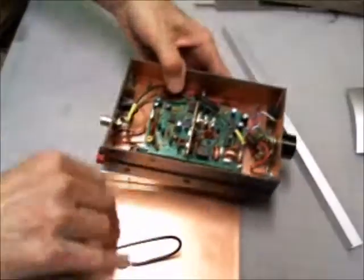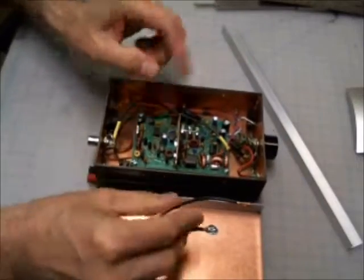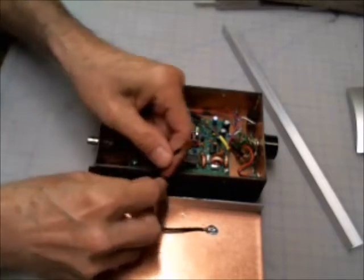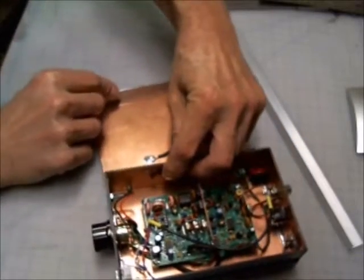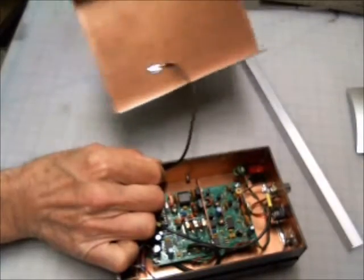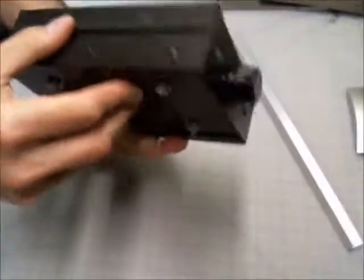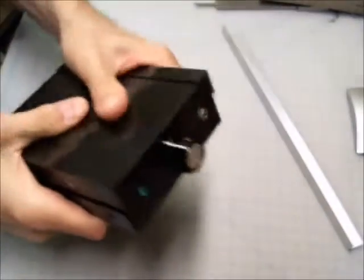In order to maintain ground contact, I've got this heavy 12-gauge wire soldered to the top. This will go on the inside, solder in here, and then they'll be attached, and then I can put that on top and just screw it down — since I've already pre-drilled here — and I've got this nice little package.